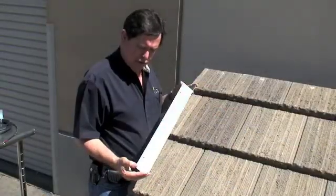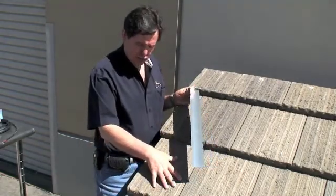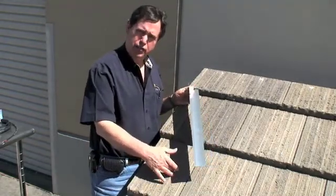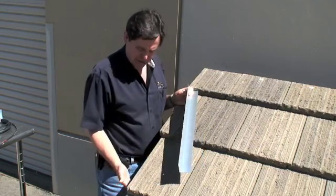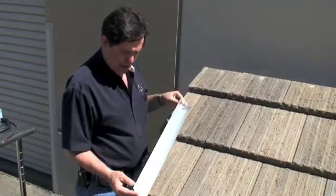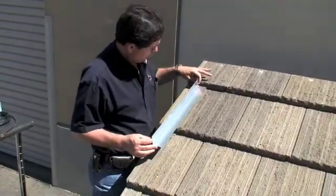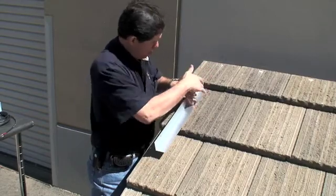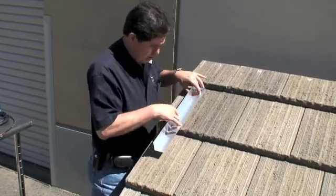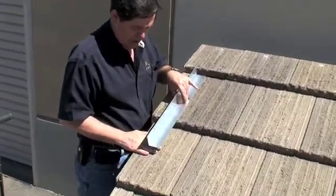It's going to require the use of a two-inch by two-inch L-bracket. It's installed on the edge of the roof so that we can run the wiring output from the solar panel directly into the attic over the drip edge. The first thing we do is mount the two-inch by two-inch L-bracket to the roof. You can mount it on this plane here where we run the fasteners through and let it cantilever slightly over the edge.